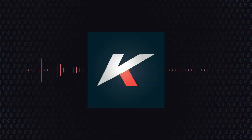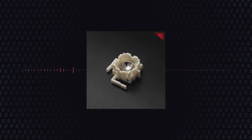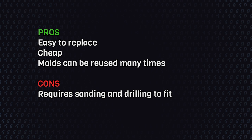And there you have it, another fix for the dreaded 64 sticks. The goal of this project was to have an easy replacement solution that you could do at your own home without the need to order parts online. And though this isn't perfect, literally anyone can do this inside their own house. All you will need is to get a good mold first, with the bowl being the most important part. Even the steel sticks have only the bowl made of metal, and the surrounding part is entirely made of plastic. Sure, the bowl will grind too, just like the plastic piece, but you can easily cast another resin bowl anytime you feel like it needs to be replaced, and by adding grease, the mechanism will last even longer.